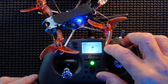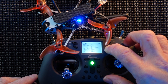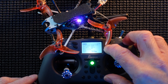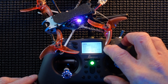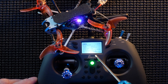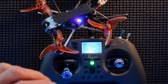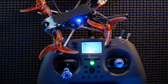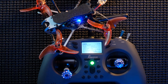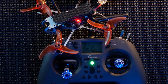Page two in the actual menu we just set up. Scroll down. And this is where you're in the internal RF, and there is a little bind right here. Press over and we're going to hit that bind by pressing the enter button here. And that will start the controller chirping or beeping. And that is now communicating — see all the lights are changing. And that actually just bound absolutely perfectly.